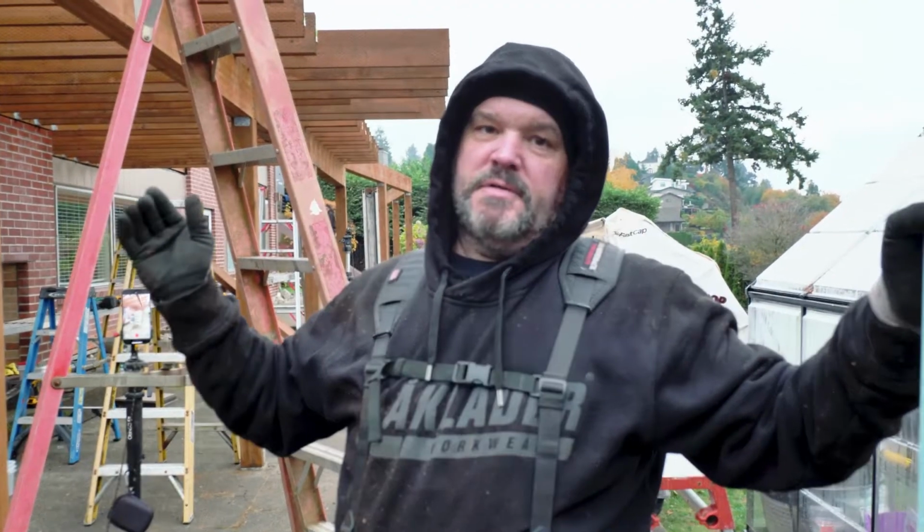All right, so now all the joists are connected to the house. They all have joist hangers, and they've all been screwed and secured. So it's now safe to walk on those joists, except for the fact that we don't have them locked down on this side of the beam. Now, we graded all of our framing originally where these joists are gonna set out over the beam. We took a level and chose the thickest board all the way to the thinnest board and laid them out, but there's still some discrepancies in some of these joists. So now we're going to go back and double check over the top of the beam.